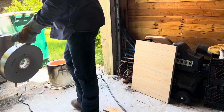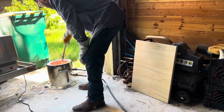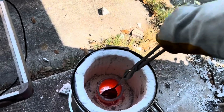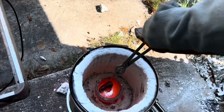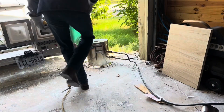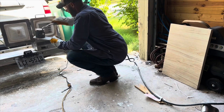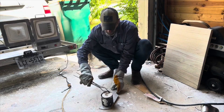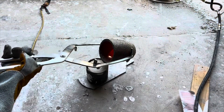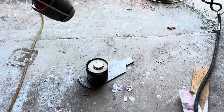This thing is really hot, so we've got to make sure it's not too close to anything — it can melt. So this is red hot. It's taking the top part of that and getting any little particles or trash. That'll stay molten for quite a while to avoid it cooling off too fast — we'll go into thermal shock and breaking. And this thing will slide out of here, so that's why I need a bottom on it. Bring it over here, make sure it's not going to touch anything, make sure nothing is in our way. We're going to pour that right down in there — this is super hot. There we go. We'll put it back in.